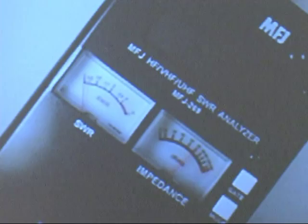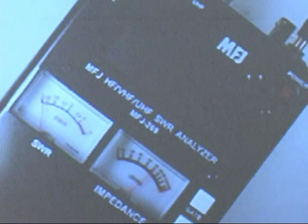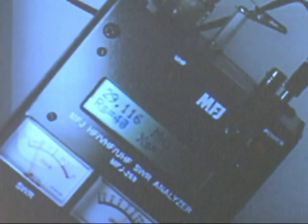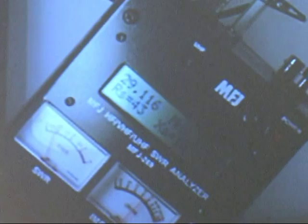That's all — you've got to have some of these radial wires here to make yourself a 10 meter antenna. Now you can take this and raise it up a little bit and look at what frequency it's resonant at. Right there — about 29 MHz, a little bit high. But all you have to do is raise this up a little bit or use a different ground — a longer ground. When you have something like this you really need some more wires out there to make a ground.